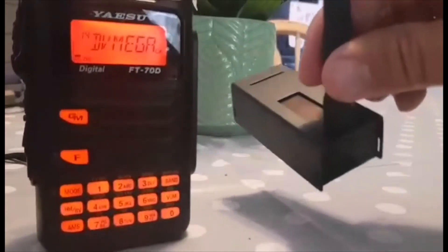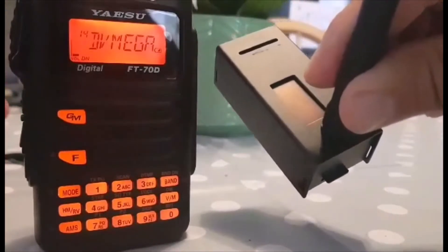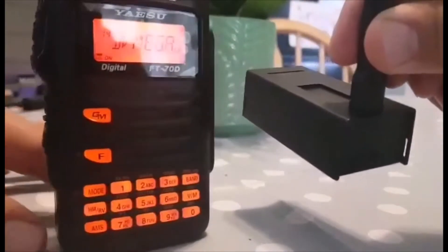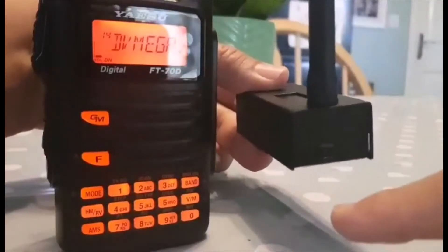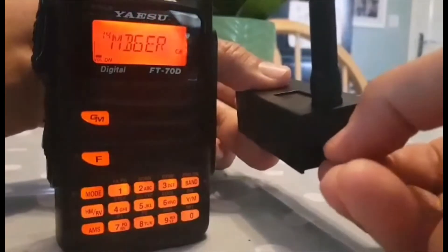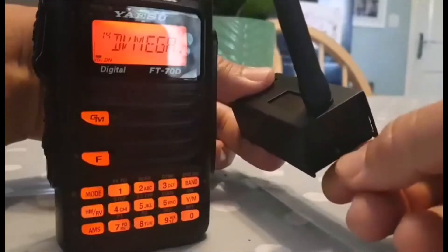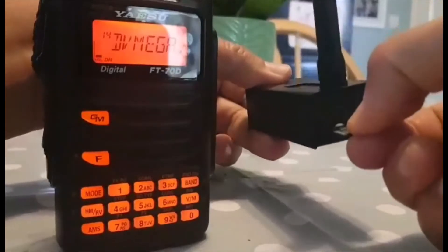You've just got it, it's preloaded with an image but it hasn't got your Wi-Fi details on it. So let's get them on the SD card and configure this thing to connect to the WiresX system. I'll show you where the SD card is - it's here, a bit dark - you just slide it out like so, and it goes back in that way as well, just be careful to get it in the little slot.